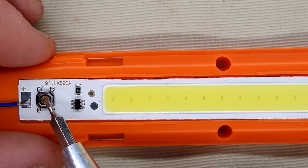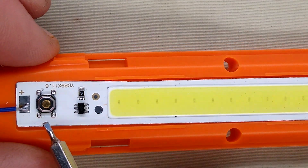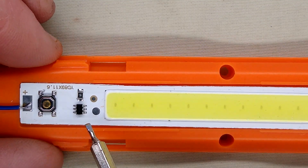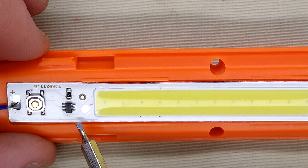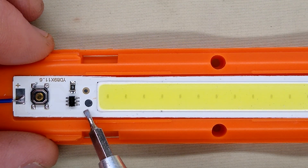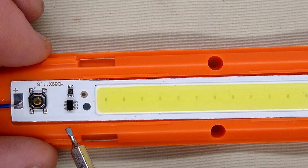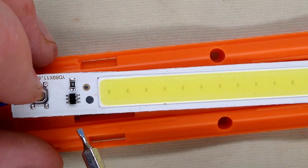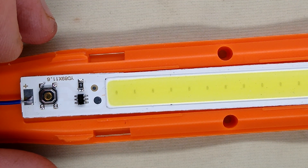That's really not much else to say. The button is identical to the other one - that sort of car remote control type button, the little gold dimple button on top. The chip number is 6066A. Not really sure what that is, whether it's a standard chip number or not. I may take a look for a datasheet, but it's pretty much going to be one of the standard YX type chips or a clone using the same pinout. The COB is basically loose and just sits into a slot, a little channel in the plastic. It's quite a nice little light - very effective and very bright.